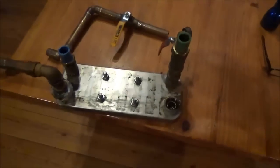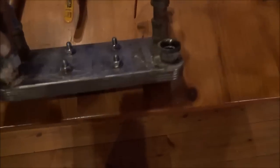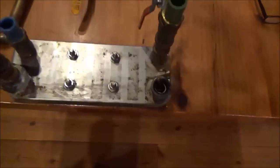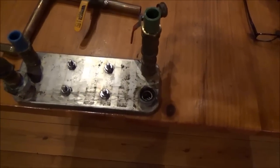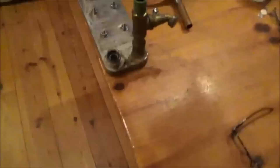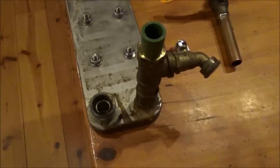I'm engineer 775, wanting to soup up my ability to make hot water. I had a six-plate heat exchanger for about eight years and it's just not doing it from a thermal siphoning standpoint. I got tired of it. The plates are so close together they clog, and there's corrosion — you can see some on the outside. I'd flush it out from time to time, but there was just too much corrosion.